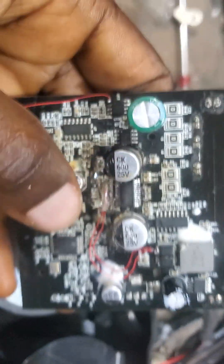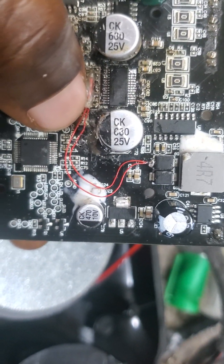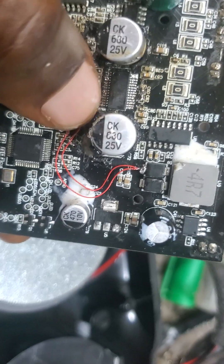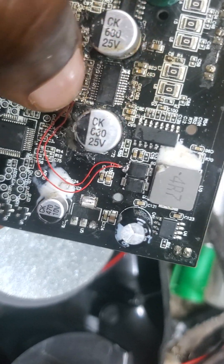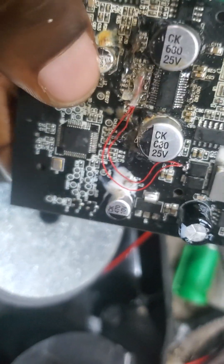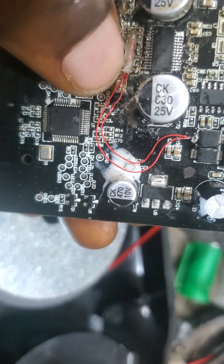Another thing is the power — there's a key resistor here. This VCC — this right here is VCC. The pins are 14, 15, 16 and 27, 28 — that is 28 should be the VCC pin. The same thing here, it should be at this side, but there is also a break in it. That's why I made this jump — for my VCC line. It comes to here.